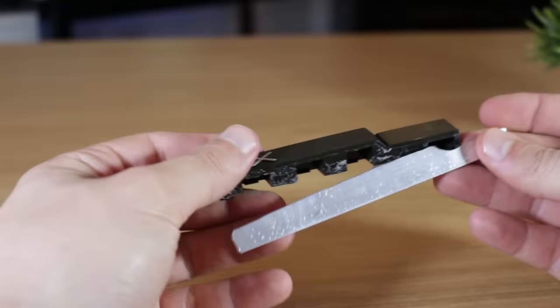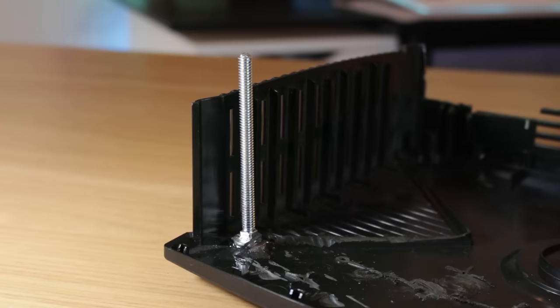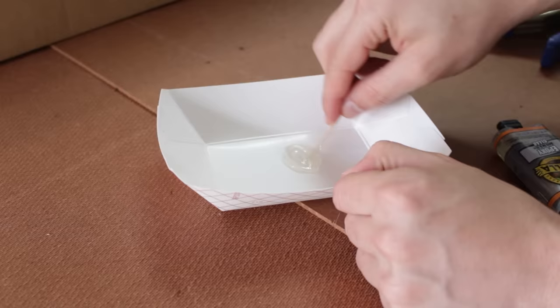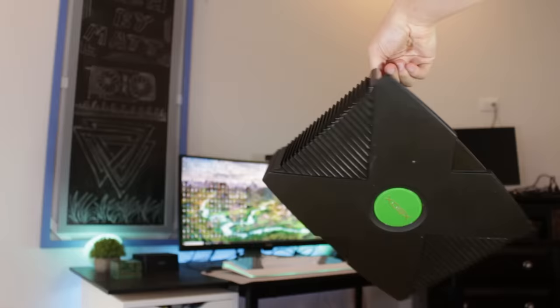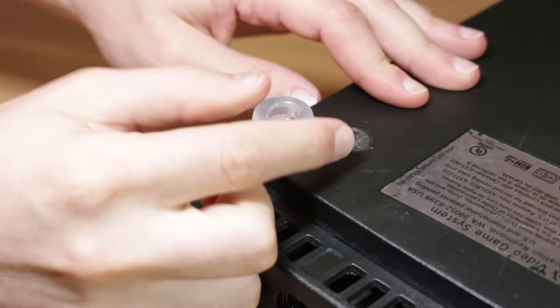I needed to figure out how to attach the drive bay cover that used to sit centered on the CD drive itself. I machined down a piece of bar aluminum to a similar size and used it as a spacer — it's clearly not original but it looks nice and matches the silver Xbox logo. For case retention I used two-part epoxy to attach two bolts to the top panel that slip through the bottom panel and get bolted in. I also found silicone furniture feet from Home Depot that screw onto the exposed bolts and hold really well, and added two more feet permanently fixed in the back with epoxy to raise the case up.